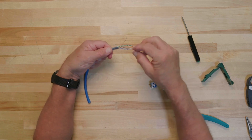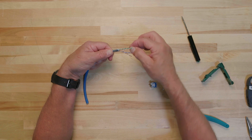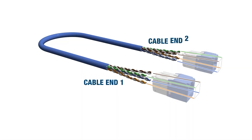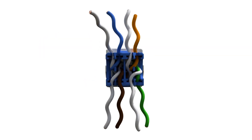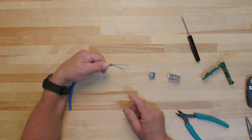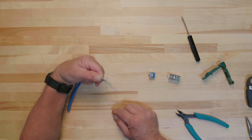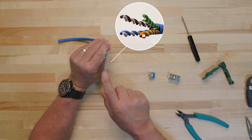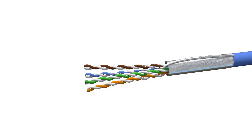When terminating cable end 2, the objective is to maintain correct wire mapping between ends 1 and 2. The steps to terminating cable end 2 are similar to cable end 1 with two main differences: the orientation of the conductor pairs compared to the wire cap and jack module, and the positioning of the pairs in the wire cap. Begin by preparing the cable using the same process as cable end 1. Remember, on cable end 2, the brown pair is on the top left and the blue pair is on the bottom left. Ensure that there is a solid continuous piece of foil positioned between the green and brown conductor pairs. If there is a drain wire present, route it between the green and brown conductor pairs and pull it back towards the cable, laying it on top of the foil shielding.